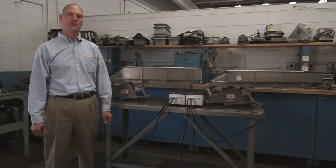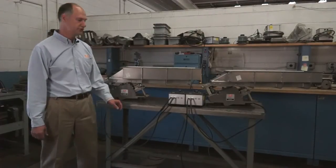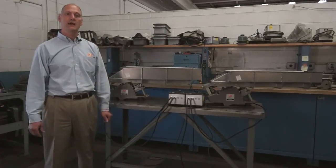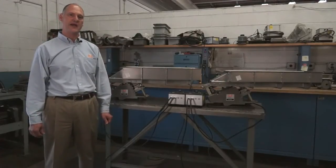In normal operation at full voltage, the tray displacement is measured at the back of the tray with the displacement sticker. Consult your installation, operation, and maintenance manual and the nameplate on the side of your feeder to determine the unit's maximum displacement.